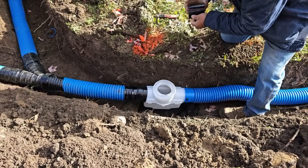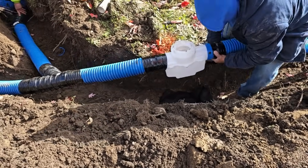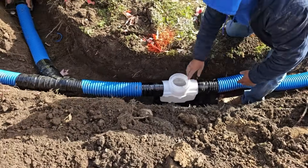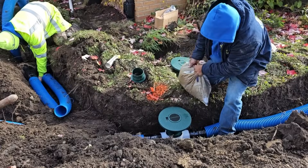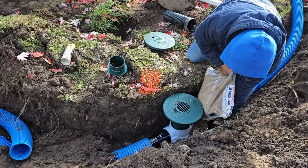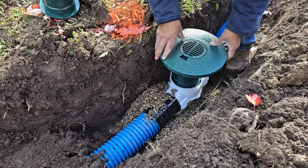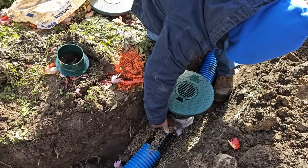It's 35 degrees here in Michigan, so everything has a lot less give and a lot less flex — but still a really nice connection. We're putting a little drainage stone around and underneath the catch basin so that after a rain event, water can leach into the subsoil. We drill really small holes in the bottom of the catch basin.